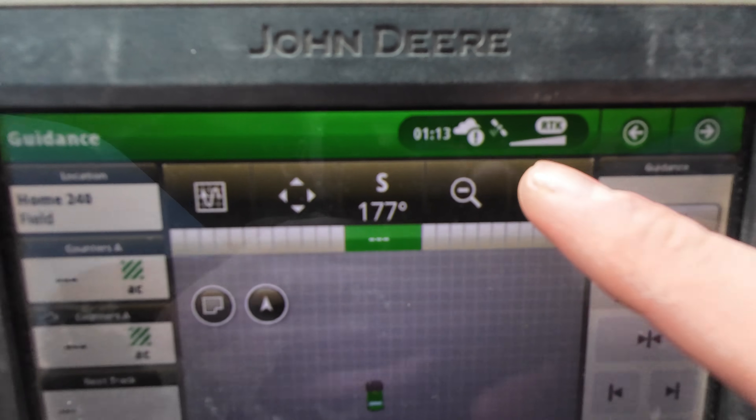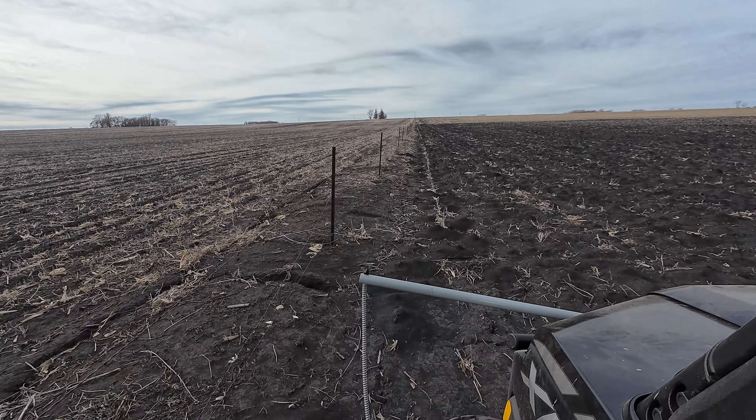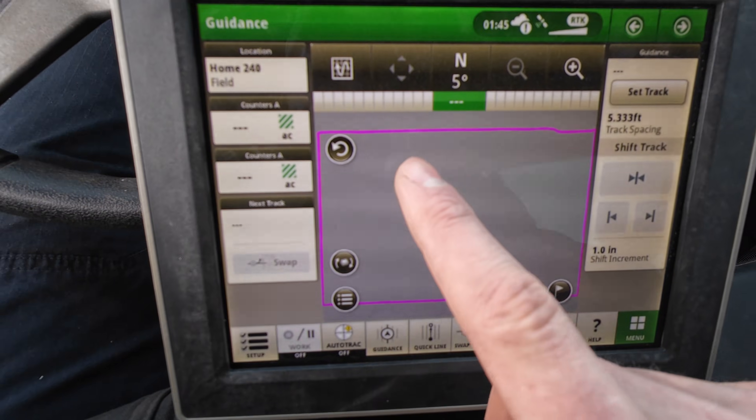We're at the first field ready to start mapping. You can see we've got RTK signal. This is actually my field for this upcoming year — margins are tight in farming right now, so I'm going to try to get as close to the field edge as possible to get as many seeds per acre planted. The GPS globe and this computer inside the Ranger means we shouldn't need to touch the steering wheel at all going around the outside edges. We'll do a quick buzz around after to make sure everything mapped exactly like we want, then offload the map onto a USB and plug it into the computer to verify it says RTK.